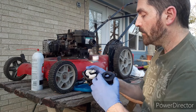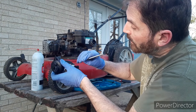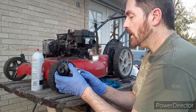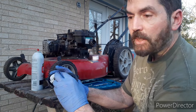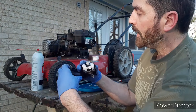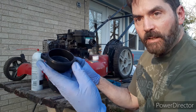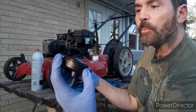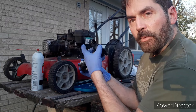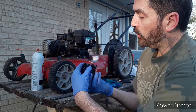There's only one way it goes on there. See the nozzle on this thing? That nozzle creates a spout shape. This square on here goes right over that — that's why it's there, to give that some space. This is what sucks the fuel in. This is the lowest part of the fuel bowl on this thing — that's why it does what it does. Gasoline goes in there at the lowest part, so only when it runs completely out of gas will this thing shut off. Right over the top of it. Don't pinch your O-rings.